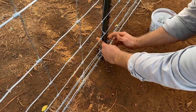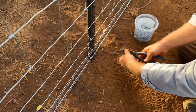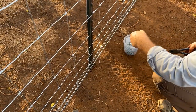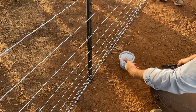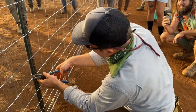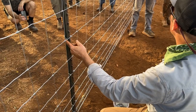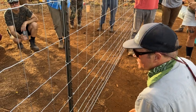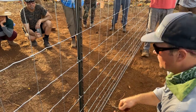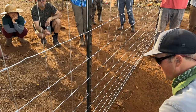As uncle here has been saying, those pigs are smart — those pigs are a nuisance. You spent all this time, effort, and money. If it's really all about pigs, clip every one of them down there — don't skimp on it. There's no reason not to put in a 10 cent clip. Make sure to come back with your lineman's and pinch them, because they will pop. So just give them that little pinch. If you want to tighten them more, pull that around more — once you get it around, pull it more. Now that bugger is really on there.